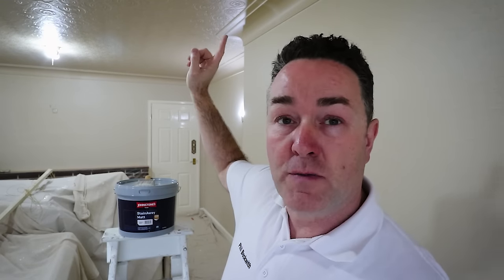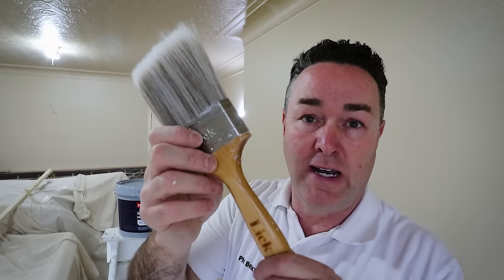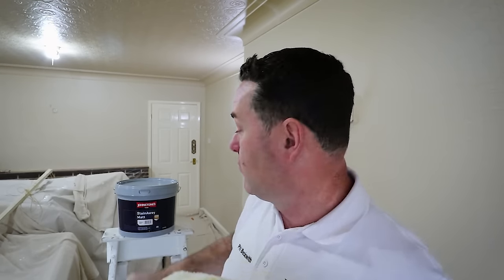What we're going to do is paint the ceiling today - two coats. It's touch dry in about an hour; recoat time is four hours. I'm going to go around with a brush - I do like my three-inch lick brush for cutting in around ceilings. Then I've got the long pile Rotogold roller, and that's what I'm going to be using because we've got a texture on the ceiling. A longer pile giving a bit of texture on the ceiling doesn't really matter.